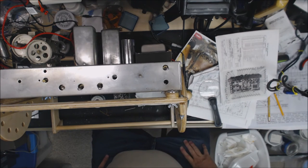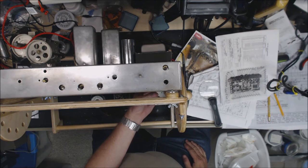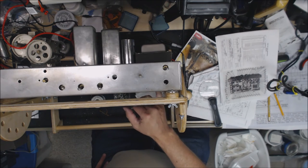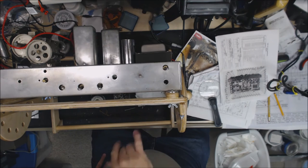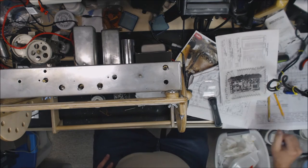So I replaced that here with the appropriate safety cap, then put a rubber grommet in on the hole and get my three wire cord in here and start wiring back up from that. So we'll go ahead and let that dry, cure, and then we'll start on putting the cord in next.